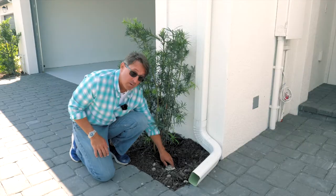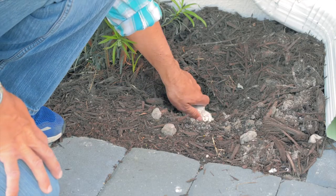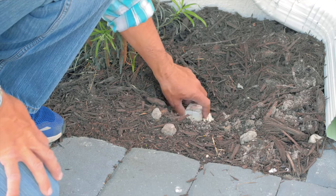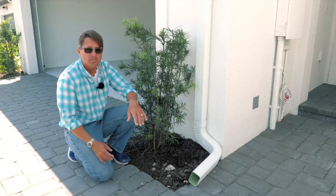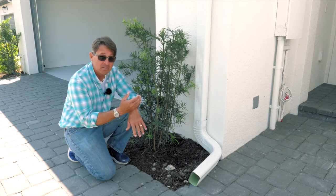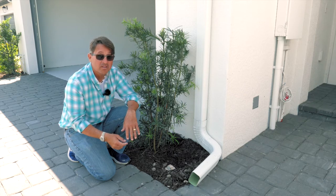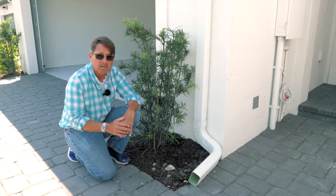After that, this is important to know. If you do have a clog in your home and you have sewage backing up into the home, you will want to come out and take a pair of channel locks and remove this cap. What that will do is release the pressure and allow the sewage to stop backing into the home. It will be coming out here, so you will want a pair of gloves and you will want to move quickly, but it will stop the sewage from coming up into the home.